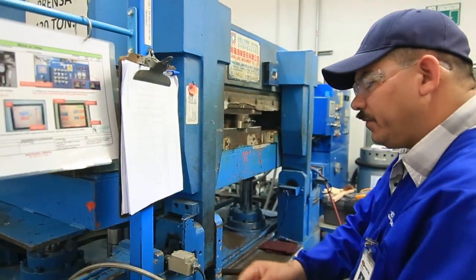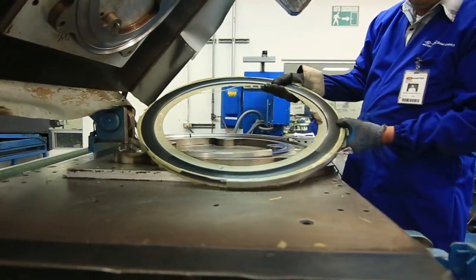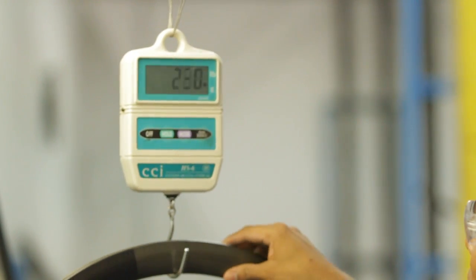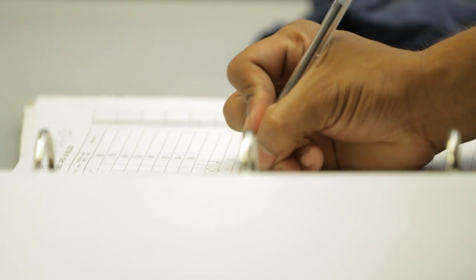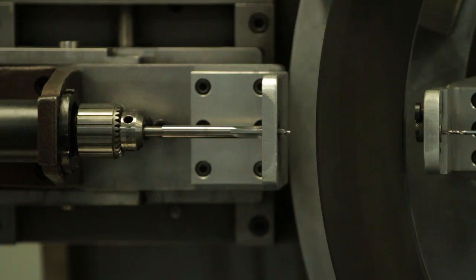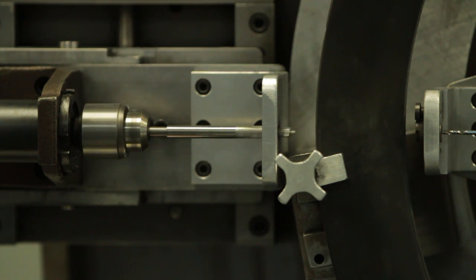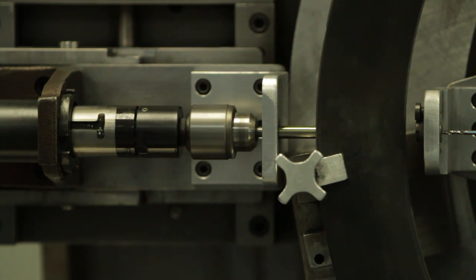You'll notice that the resin on the outside of the rim as it comes out is very even and uniform, meaning you've got good compaction and good resin flow throughout the system. The resin is then cleaned off and the rim is weighed, recorded, and marked. It then gets passed into the drilling room. The drilling process is a two-stage process: first drilling a hole from the inside of the rim to allow access for the spoke, then a second drill from the outside providing access to the nipple as well as spot facing where the nipple will sit.